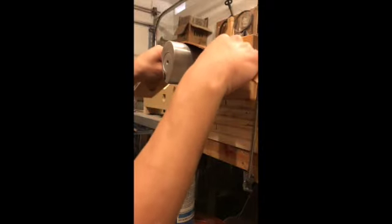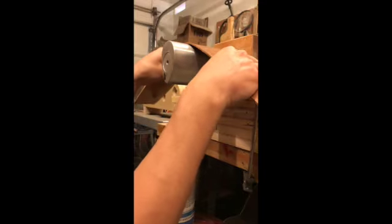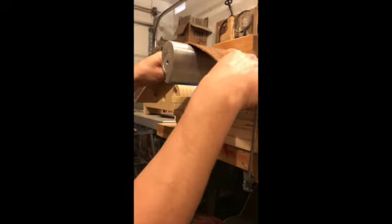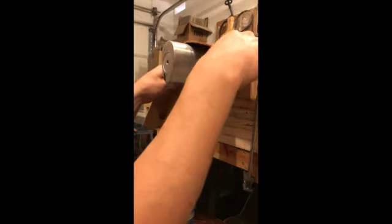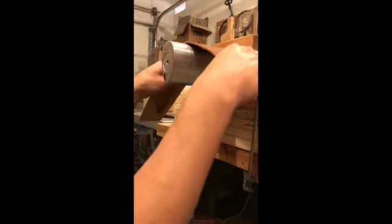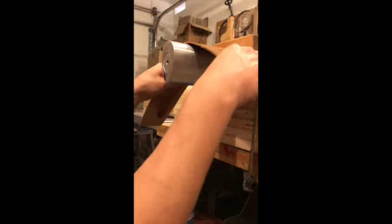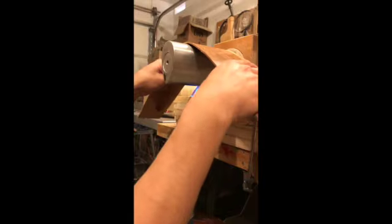You want to be real patient with it. The wood is going to bend or it's going to break, and if you force it, it will most likely break. Sometimes it will break anyway — there are a lot of stresses we can't account for in a lot of species. I've definitely had wood shatter that I didn't expect to shatter. I've encountered what I call flake cracks — cracks through the layers of the wood, like the wood delaminated on me. Mostly mahogany tends to do that.